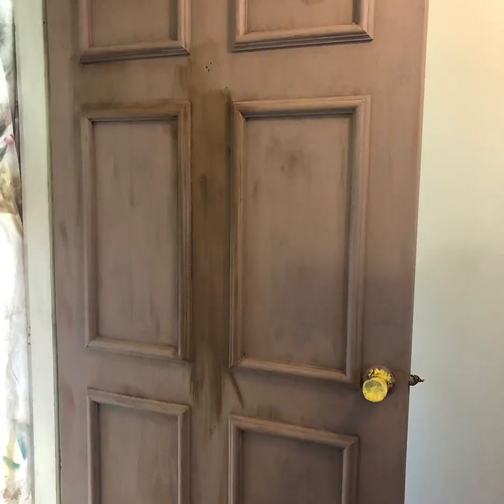So this is after I applied my brown paint, and actually to let you know, this isn't the color that it was at first. The brown paint that I had purchased was actually too dark. So you want to try to find a lighter brown for your base coat, because once you put that gel stain on, you want that lighter brown to show through. So if I'd put the gel stain on top of that dark brown paint, you wouldn't have been able to see my wood grain look.